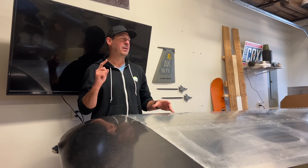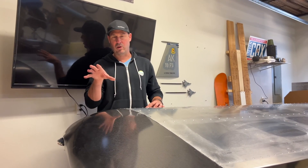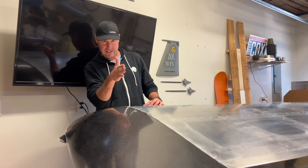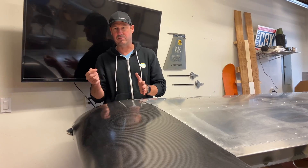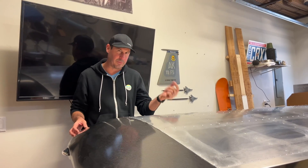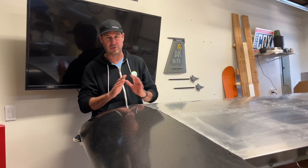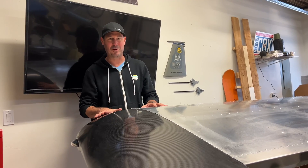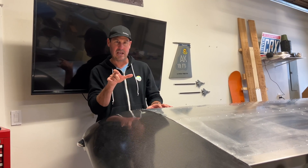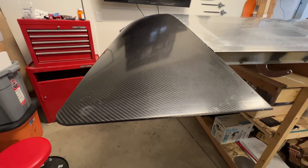That wraps up this episode. Next is the fuel tank and lift strip, then we swap wings — get the right wing up here and lather, rinse, repeat. The lessons learned: there was no fussing with straight lines — this came out of the box almost ready to go, just some match drilling, really a dream. Comparing to other people's experiences with ABS plastic wingtips on YouTube, those seem very hard to get a perfectly straight line. It's a lot more expensive, but you do get a little more performance — about a 16 to 18 inch increased trailing edge span, which should help with wingtip vortices and induced drag. Very happy with this — thanks for watching. Until next time, Steve, you're clear.